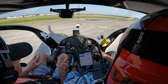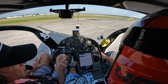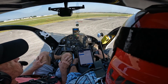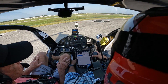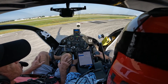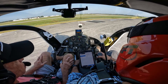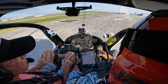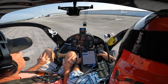We're going to go ahead. When we come up, we do a nice slow pull on the collective, the cyclic. We do a two-stage — we get her light, stop all the movements, then slowly bring her up into the air. What we're doing here is feeling the CG and controllability. With the big guy in the right seat, we're a little right skid low. That's fine. Our hover power check at about 6 inches is 34 inches — we're looking good.